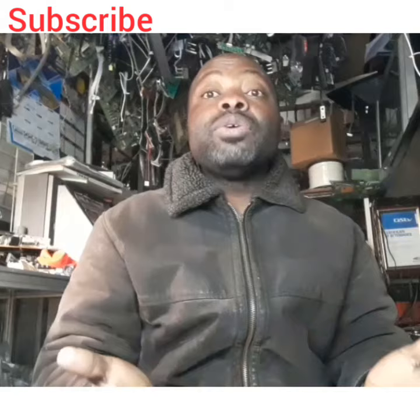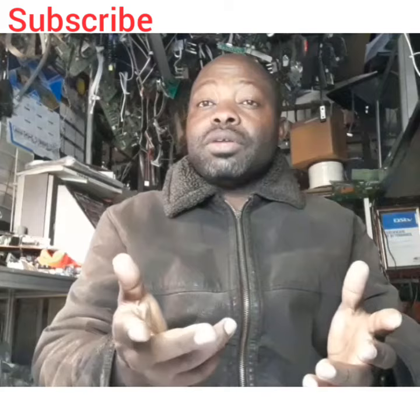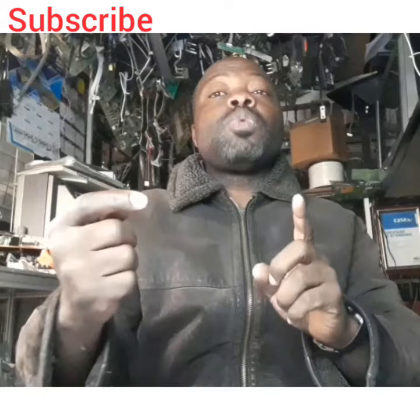Okay, you know at home you've got an LNB cable going to the back of your decoder. Always check if your LNB cable is well connected to your decoder, and always check if it is well connected to your F connector before being connected to the decoder. I'll show you in this video how to connect it properly in a simple way at home by yourself, how to connect your LNB cable with the F connector and how to screw it properly at the back of your decoder. Then you'll be solving the problem of E48 due to the wrong connection.